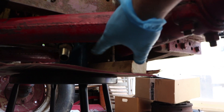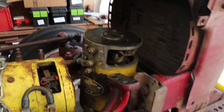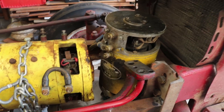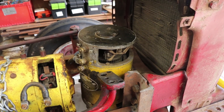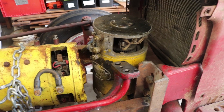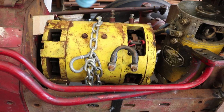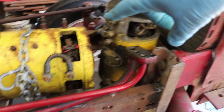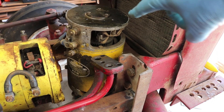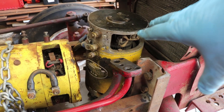So I don't think having the hydraulic pump lower would be an issue. That's where we are right now with the general spacing, positioning, and proof of concept for an electric DC motor to drive the tractor and the PTO, and then a separate DC motor and hydraulic pump to power the hydraulics. Essentially, it's a forklift.